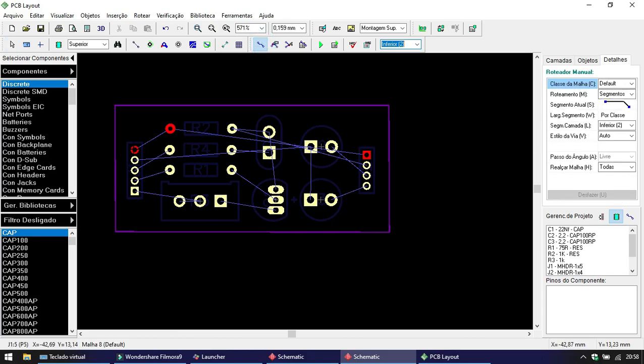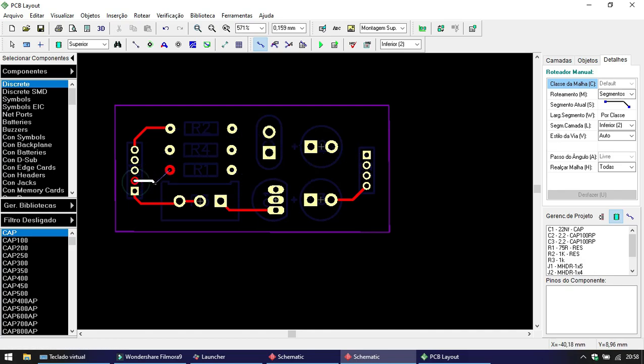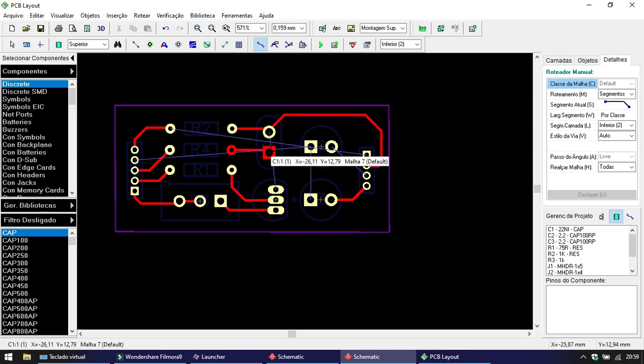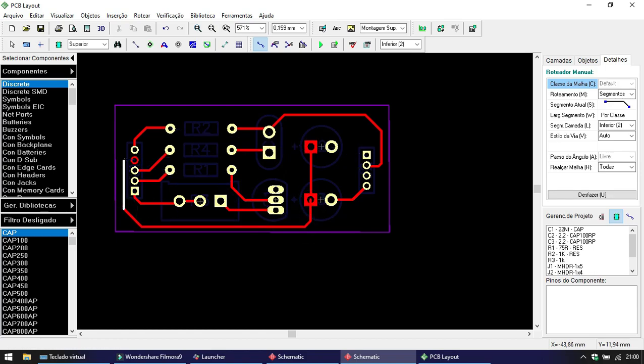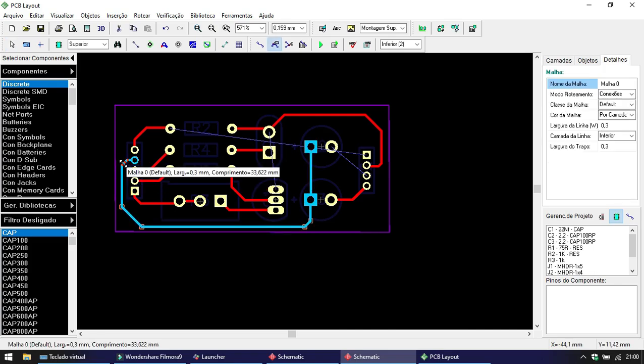Now I'm defining the board outline, the contour of it. I clicked that icon and here I'm defining the size. Now I'm going to design the traces — all this on the bottom, the solder side. So I'm going to flip to that layer by clicking the icon. The way I position the components, the traces are shorter, making connections easier. My intention is to connect the traces, leaving the ground net for the components connected to ground, because I'm going to make this copper-clad board on top and bottom — just having the outline of the traces. The copper area will serve as the ground plane for the board, making it shielded. As it's a board that will work with video, that is already excellent.